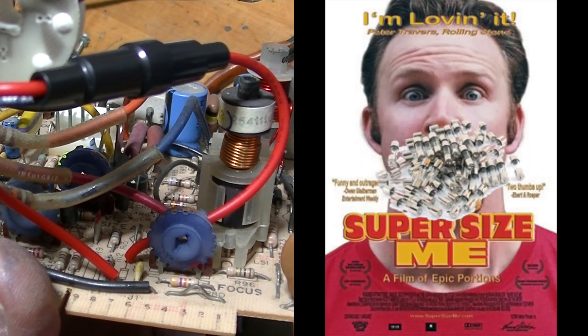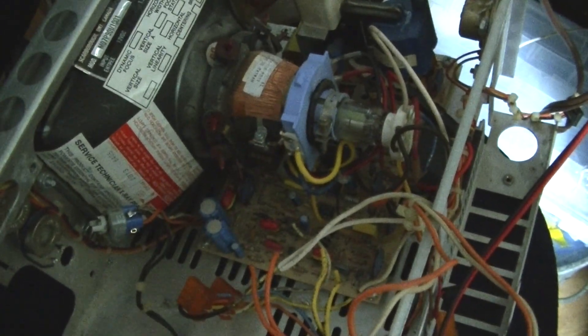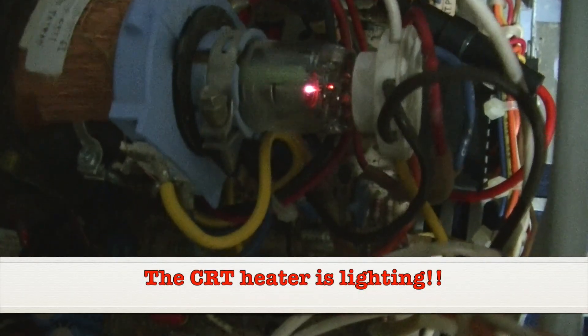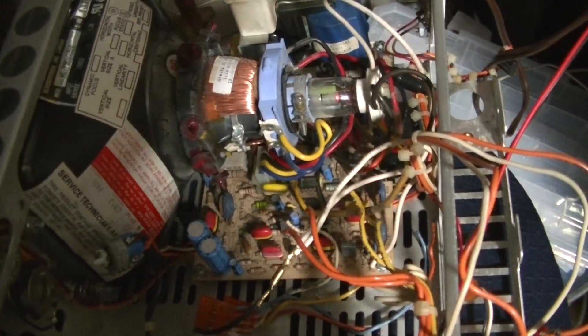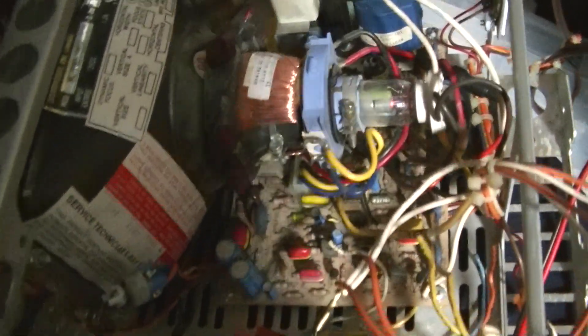You don't supersize your fuses. Now I can apply 12 volts to the monitor and see if it powers up — if I get a heater lighting up, or perhaps something on the screen, no characters, just maybe a raster. It's drawing 0.73 amps, and I'm not getting anything on the screen. I'm not hearing anything either. There's no question it would not have worked before. There's no guarantee that it works now, but at least there's a chance it will.